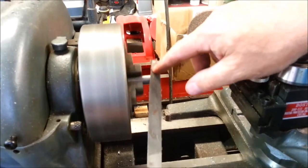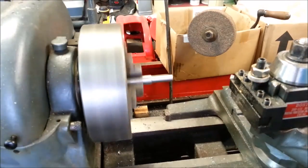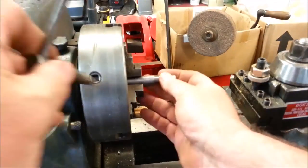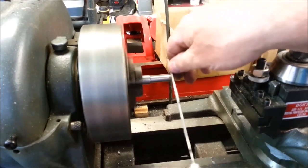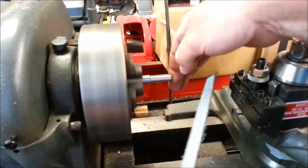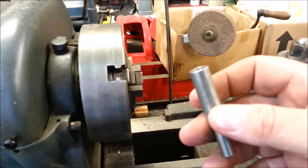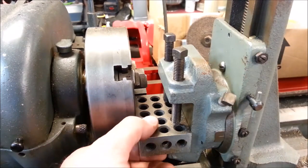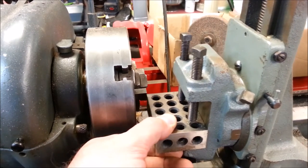We need to de-magnetize this file. Not happy with that — it's still got an edge on it. That's better. I think I need to put the milling attachment on. I'm showing here how I quickly square this up close enough for jobs like this, just by using a 1-2-3 block from the chuck to the back of the vise jaw.